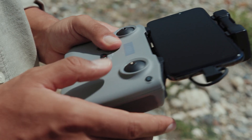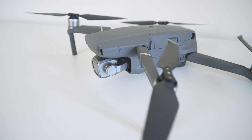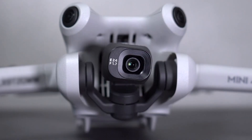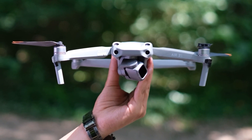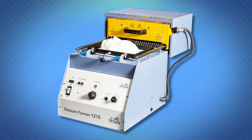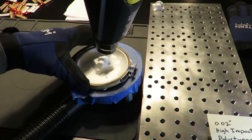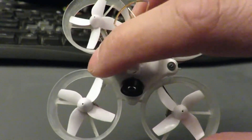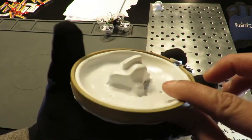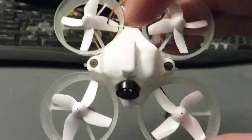Together, all the elements will allow the drone to follow programmed flight paths and adjust mid-flight operations. Another key system is the payload mount and protective cover. The payload mount is designed to hold critical equipment like the hard drives and camera, and it is linked to a servo mount for precise camera movements. The mount pivots allow aerial views to be adjusted in real time. Using a vacuum forming machine, factories can shape lightweight plastic covers that protect the internal systems, and factory workers trim the plastic covers to precise dimensions using milling machines before securing them to the drone's body.